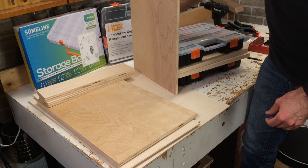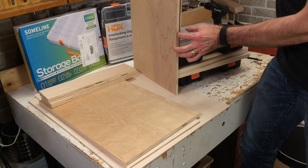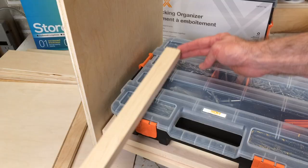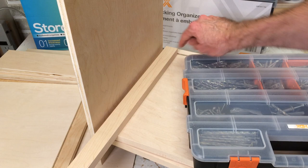The reason is I'm going to add little slots of quarter-inch board and then put in inch-and-a-quarter pieces of hardwood maple, stacking those up one over the other. That will give me lips that each of these organizers can slide into. There's one-and-a-quarter maple I need to cut to length — it needs to go right to the back of the cabinet. So I'll line it up with the dado, mark it to length, and then cut it on an angle at the front.